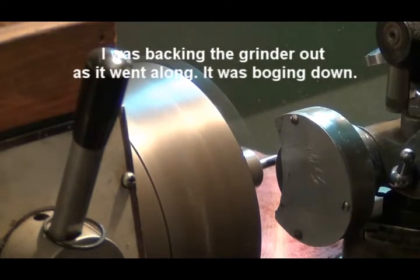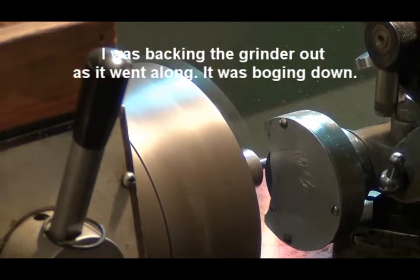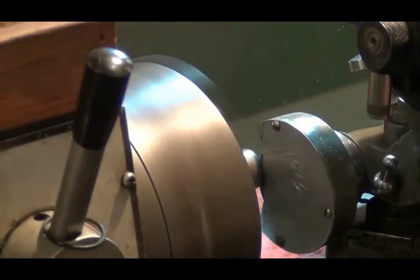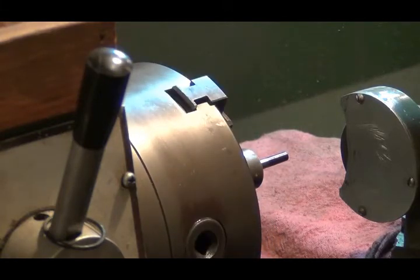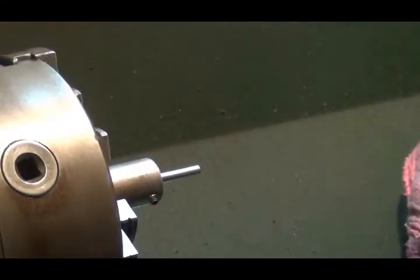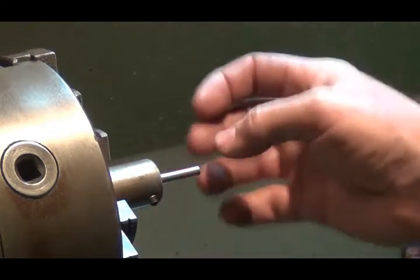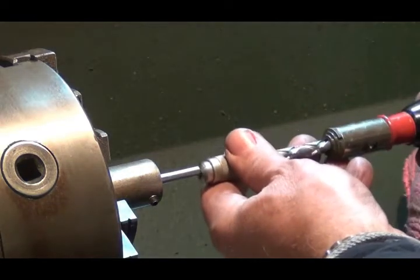Sounds like it's a little too much. I'm not going to be able to get right up to that shoulder. It looks like it's got a little warm — yes, it's warm. Well, I used the tool post grinder and just barely skimmed it, then went in a thousandth at a time until it was parallel, because it seemed like it was thicker — the diameter was a little bigger here than it was there. I got it all smoothed out and it just fits.